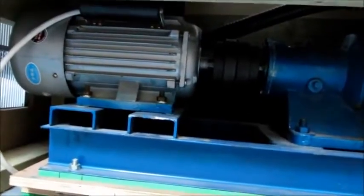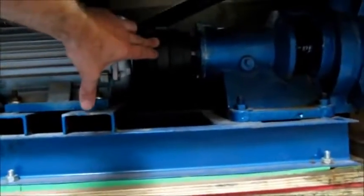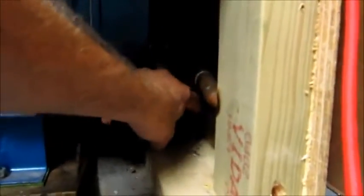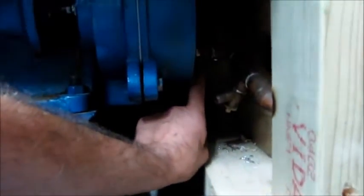Okay, so we've got, I believe, a 3 horsepower motor, but I can check that. Then the two shafts are joined by a special coupling which is designed to join two shafts together, and then the blue section here is the water pump. Basically, water is fed into the bottom of the pump through a 1/2 inch BSP tapping, and inside this housing, which is as wide as my fingers, is a cast iron paddle wheel.